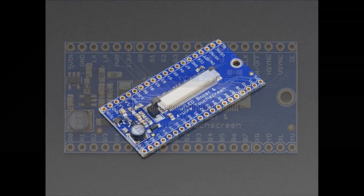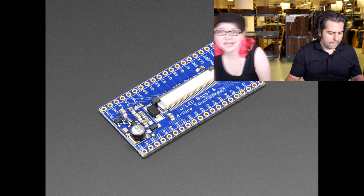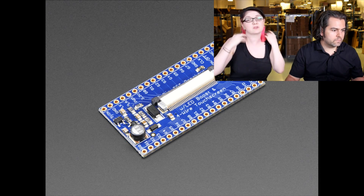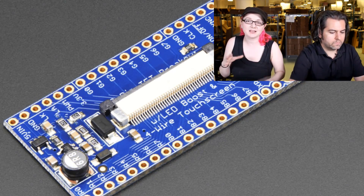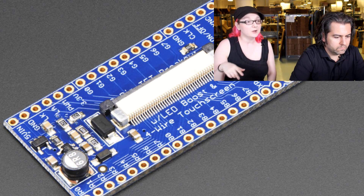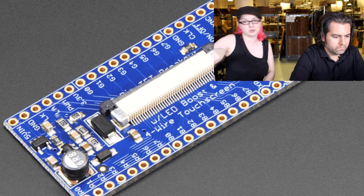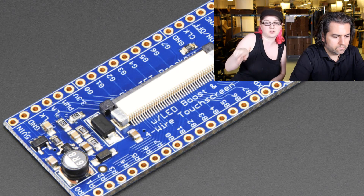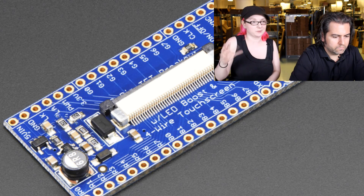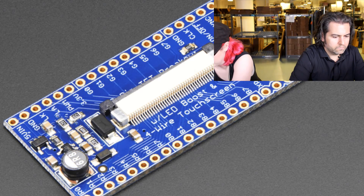This is a 40-pin TFT Friend, which is a device I created in-house when I was working with all these displays. A lot of them have 40-pin connectors. The thing about these is they have a backlight that has seven LEDs in a row, so you need a boost converter that can do constant-current boost. This little breakout board breaks out all the pins so you can breadboard wire, and it has a little boost converter on the left — a little inductor and chip.